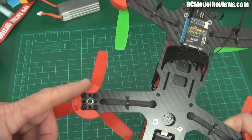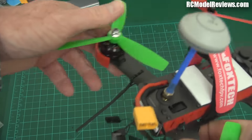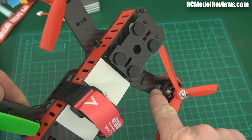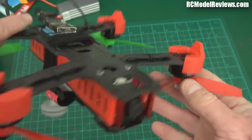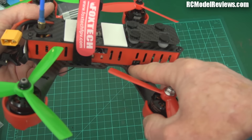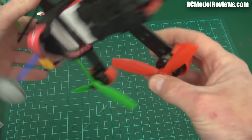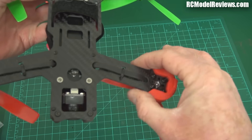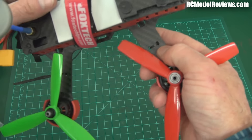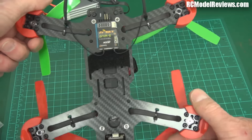These holes are for routing the motor wires. The wires come out of the motor here and they go through a hole to run along the bottom of the arm, then back up through another hole and through a hole in the side of the plate. But why bother? If you routed them across the top of the arm you wouldn't need either of those two holes. And if you ran some tape or heat shrink around there you wouldn't even need the tiny holes used for the cable tie. So this arm would be immensely stronger without all this wibbly-wobbly bend.